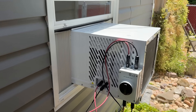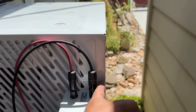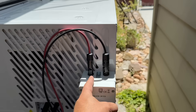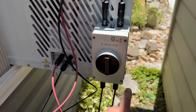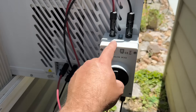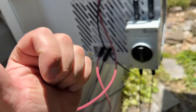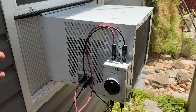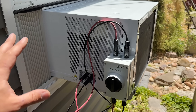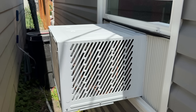From the outside, we mounted our isolator switch right here on the side and verified nothing was right behind it — the row of coils is here so be mindful, but right there was clear. We have one screw there and one on the bottom — just a short self-tapping screw. The isolator switch goes from PV positive to positive and negative to negative, and then our lines go out to our existing solar. Super easy, nothing crazy — this portion took me about five minutes. The unit sticks out about the same as a regular window unit, maybe a couple feet or a little less.